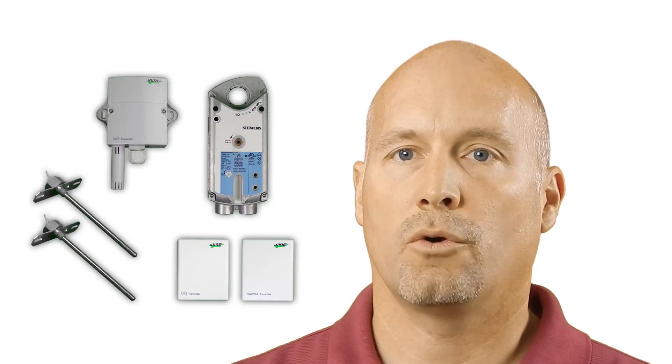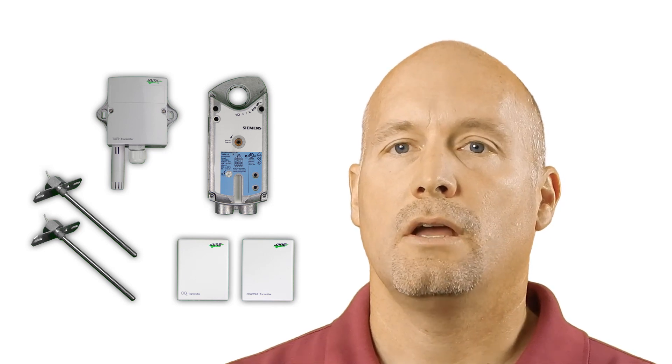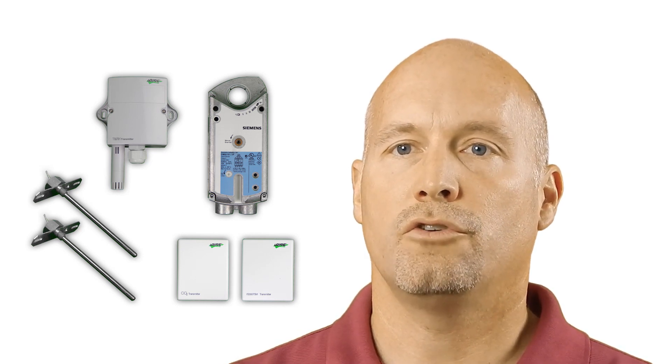The ultimate benefit of this system is that it should be the lowest cost factory alternative in the market. This happens because we do not use a proprietary communication network, and our system utilizes standard sensors and actuators — like a 24-volt actuator with feedback, 10K NTC Type 2 thermistors, and standard humidity, CO2, and VOC sensors. You are not required to utilize our sensors or actuators with the controller; we are willing to break out the pieces so you can search for the lowest cost option in building up your Economizer platform.